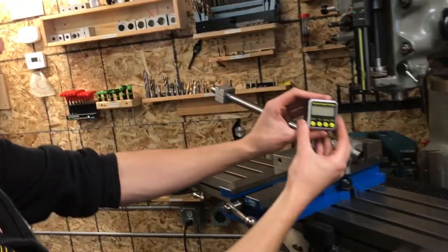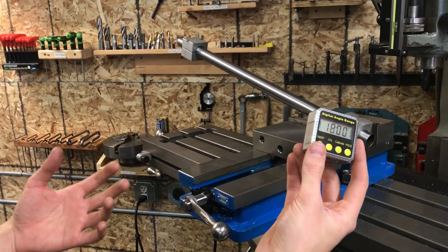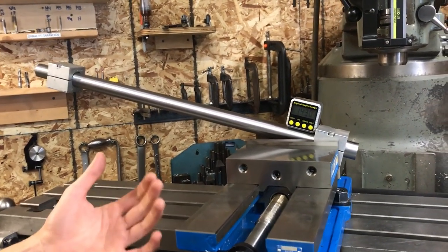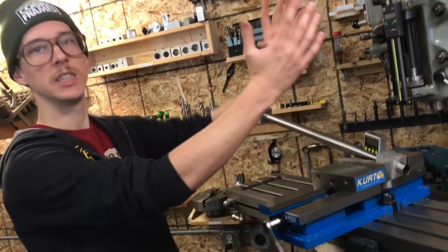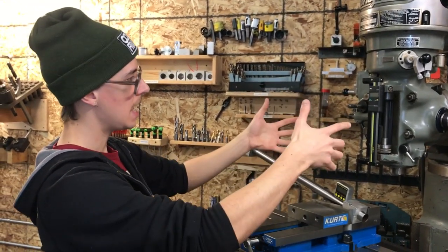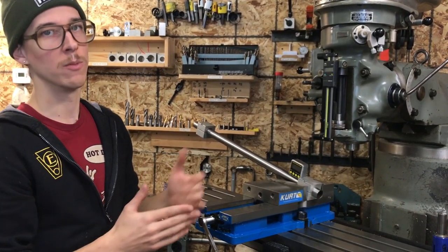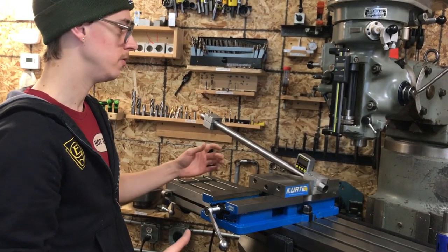I like to put it in there and then use a digital angle gauge — I got this for $35 from Harbor Freight, and you can buy similar ones from all the different tool supply places. You just have to do some math, or look at BikeCAD — I just use BikeCAD outputs for this stuff — and you set it to whatever degree you need to. This way you don't need to change the angle of the head. One of the valuable features of a Bridgeport is that the head can be tipped and nodded, the ram can move in and out — it's a very versatile machine. But I don't like screwing around with that stuff because it takes a while to put it back to 90 degrees, and you really never have to change the head from 90 degrees for almost any setup if you have other work-holding tools to help you get the setups you need.